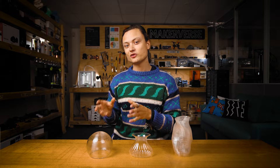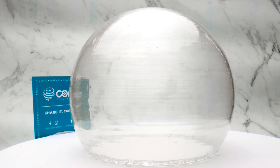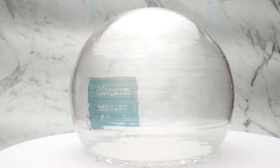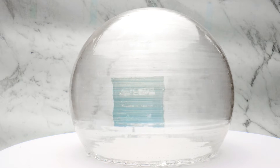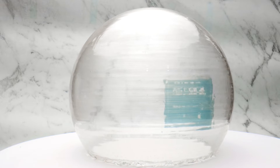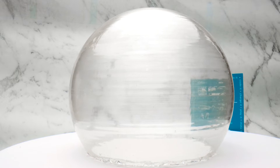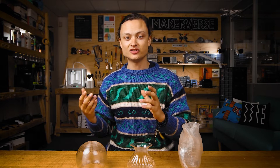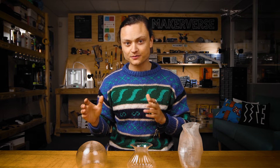Over here is a thick globe which I printed with two lines, making for a 1mm thick wall thickness. There was no space between those two lines and 115% flow was used to ensure that no air bubbles or gaps were occurring inside the material. PVA support material was also used to make this overhang work, and it was dissolved away using water. The thick globe turned out quite nicely, however it did require a couple more days of post-processing.